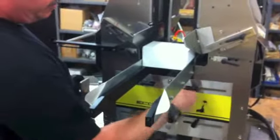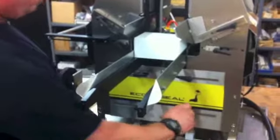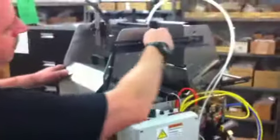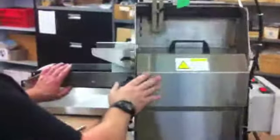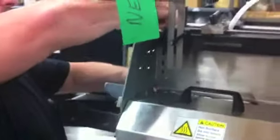Now I lifted up one of these, and what you're doing is lifting them up so you've got about an 1/8 inch gap. It is marked, but just so you know why we're lifting it. Okay, I'm going to lock these down. There's 4 on this side, and 2 on the other. Now I'm over here. With a 10mm ratchet, loosen these up. Slide this up.